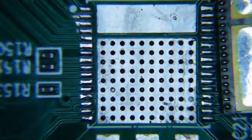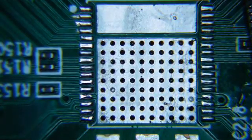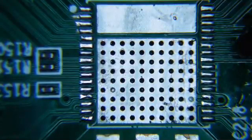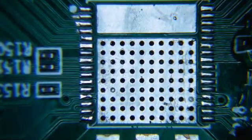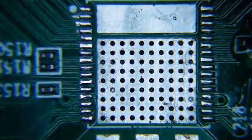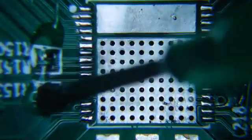I've never done it under the microscope. I usually use the hot air gun at all different angles and have lots of room, but I don't have a lot of room this time. I have a ton of boards to fix and I'm just kind of going through them. The first step I always do is flux the resistors and capacitors around the area so I don't blow them off, because things are going to get warm. Hopefully some of this flux will help the solder stay on.